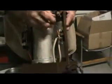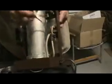It might be, if I had one of those with the little labels on the ends of them. I could make you one. See over in here, pilot light, melted. Every one of these is melted. And they melted because of the oxidation inside the case. The moisture basically just rusted the terminals and turned them into little heaters. Each one of these terminals got dirty.